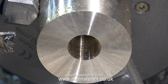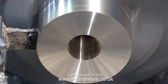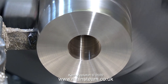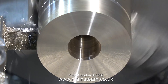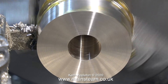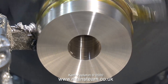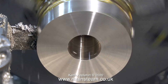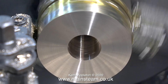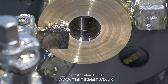The final sizing will be carried out once I have two pieces of metal to work on. With some trepidation, using my small parting tool, I'm going to attempt to part off half of the piece of metal — which is going to be far from successful at this speed. Time to go into back gear and slow the whole operation down. Now you will notice that the parting tool is actually cutting, and applying some oil makes it sound a lot better. The problem is I'm now using high speed steel, which will blunt far more easily than a carbide tip tool. Being gentle with the parting tool is the answer.